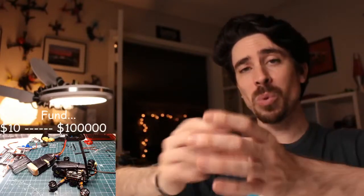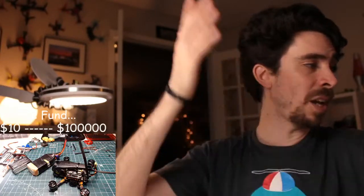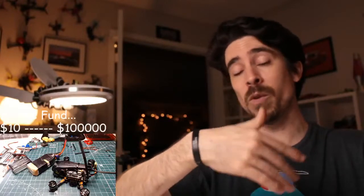If it's a 12 by 12 stator base mount, fine. If you need a 9 by 9 stator mount base, MyRC Mart sells RCX motors, and you can get an RCX 1306 that performs just like the EMAX in 4000 KV as well. You can even get it in 6000 KV, and they both have 9 by 9 stator mount bases.